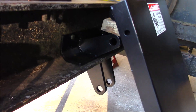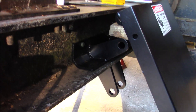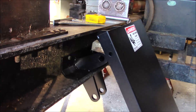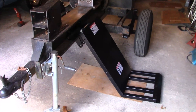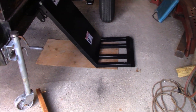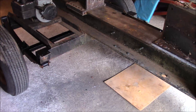After some drilling, the bracketry has been mounted to the I-beam. There's a pivot point for the loading tray and a pivot point for the operating hydraulic ram. With the two halves of the loading tray assembled together and sitting flat on the floor coming up to the I-beam, there's a distance discrepancy we had to deal with. Looks like this is going to work out without modifications to the loading tray — it's fairly close to parallel with the ground. We put a suspension lift in to bring the I-beam up, and our working height of the I-beam is approximately 30 inches.